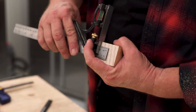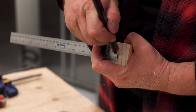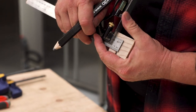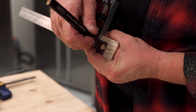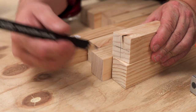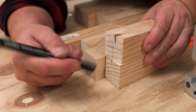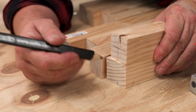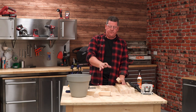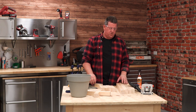We'll need to join all this together. Let's create our own little measuring tool. Best thing to do is measure in to halfway, get your pencil, put a line there, then across the other side. Now we've got a nice little cross right in the centre of this piece of timber — that's going to become our measuring tool moving forward. With our new little measuring tool, we're able to mark the centres of our timber, one on this side, and we just need to repeat that step for all of these pieces of timber, including the short pieces. Once you've completed marking all the centres of all four short legs and the four long legs, we'll need to get the bench set up to be using the biscuit joiner so we can pull it all together.